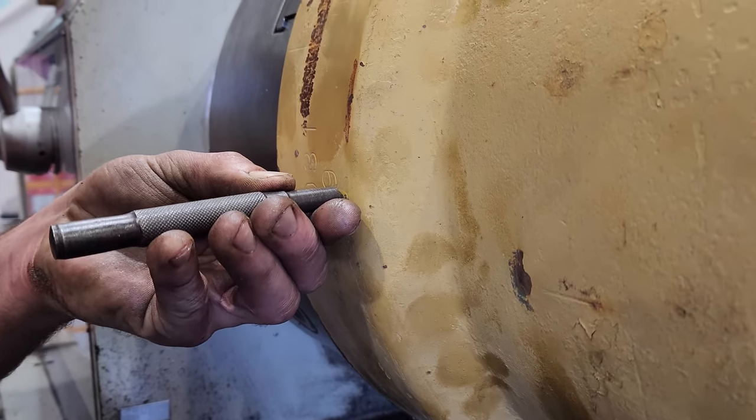So the piece of material we're going to be using is a piece of unhoned tube. The ID is 310 and the OD is 375. But we need to machine 10mm off the OD and hone 1mm out of the ID to bring it to size. Unfortunately, not all materials are available in every OEM standard size, so we buy what we can and we either process the ID or we process the OD, sometimes both. So we'll get this set up in the lathe so we can start machining one end to fit the head flange.